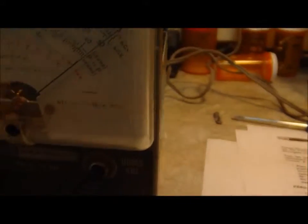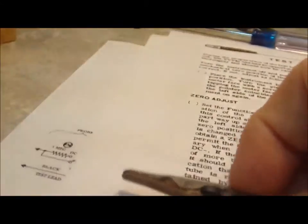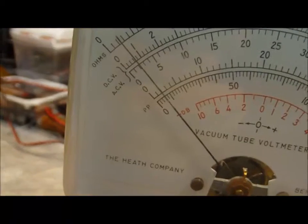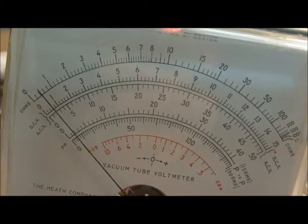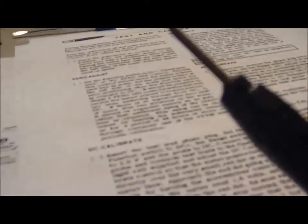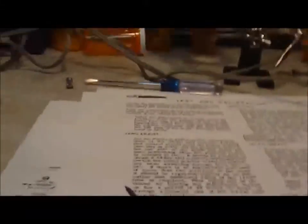Next is the ohms check. The ohms test — when you first put it on ohms, I had to replace the battery. You set the ohms adjust to infinity, which it is, and then touch the probe to the end like that. There is the reading — it's supposed to be zero, but there's always a little resistance, even in DMMs. It's not perfect. Besides that, the end of this probe definitely needs cleaning — it's not in very good shape. So I'm going to count that as good and move on to the next test.